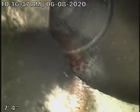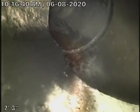We're running our camera from a 2-inch roof vent located in the front of the house. We've pretty much reached the clean-out over here in the front. The cast iron is getting a little old. We also highly recommend that you get the general inspector to run all the water everywhere — make sure everything's draining properly. You're going to need some periodic cleaning for kitchens, showers, and things like that. Cast iron is obviously getting a little old, which is pretty much normal for this house. Outside, we have a very good ABS plastic mainline and the 6-inch clay pipe is in good condition. We'll go ahead and stop the recording.